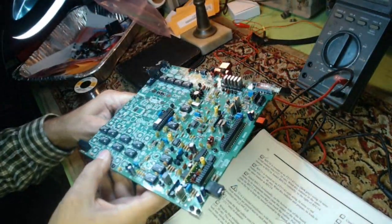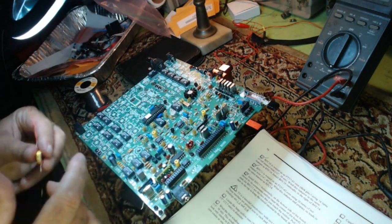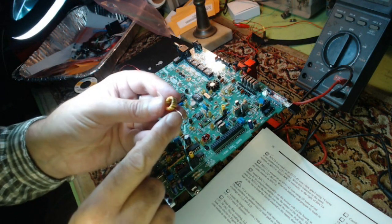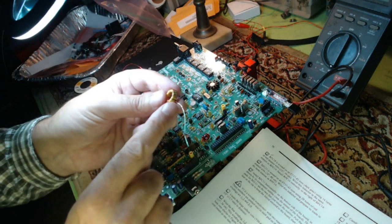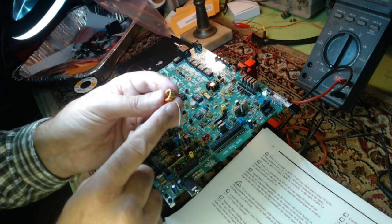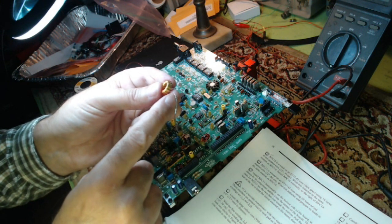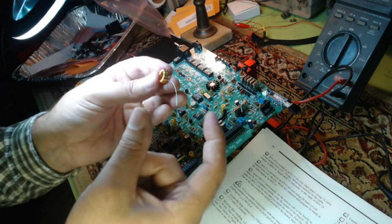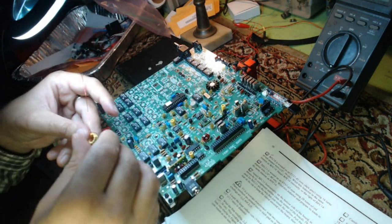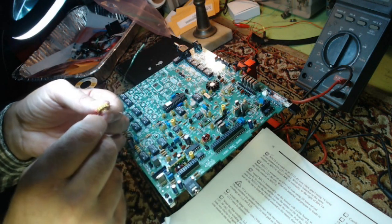And I say back on the board because this is the second time I've had them in the board, which as I said, I screwed up and redid it. And by the way, I stripped the enamel off these with a little bit of emery cloth. There's different ways to do it. Some people like to melt it off. Some people use aspirin, believe it or not, melted aspirin with heat. Although that's more for Litz wire, which is a little bit different than this wire. But I find just emery cloth folded in half and you gently sand it off. You do have to be gentle because you can pull the wire right in half. You can break the wire if you're not careful.